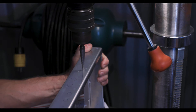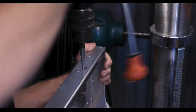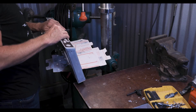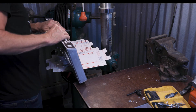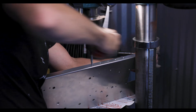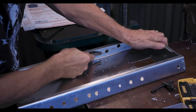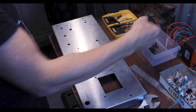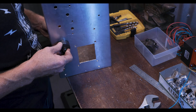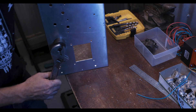Next, I'm going to drill all my holes on the back side and on the front side. My face plates are already made and pre-drilled, so I'm just using them as a template — I'll draw where all my holes need to be and get them lined up. One thing to pay attention to when drilling for face plates and potentiometers: certain potentiometers have different throat widths on the nut, and you don't want to make them oversized. The best thing to do is have the parts on hand so you can test fit them as you go along.